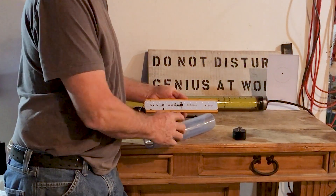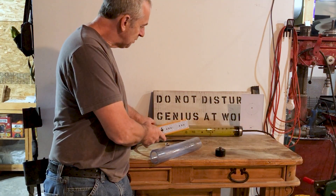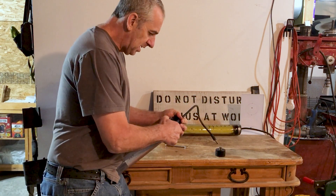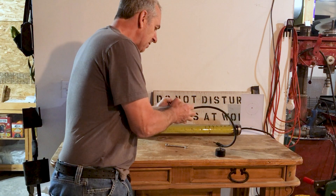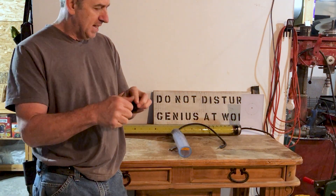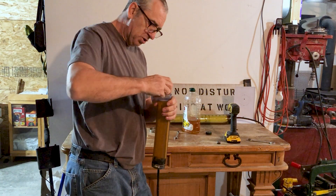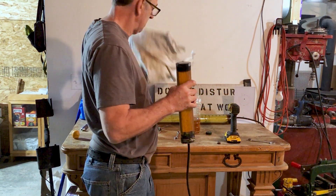Now I just slide it in. The LED board is mounted to a piece of puck board I had laying around — that's the backer to keep it rigid. This one I used wood, and I got a little pushback on that, but I'm pretty happy with the wood. I machined it so it's tight, and the o-ring is a little proud, so it takes a bit of effort to push through — and we're in. The other end is a solid plug with an o-ring groove and an oil fill plug. I fill it with good old canola oil before I put the end plug on. I push the plug on past the o-ring. I've overfilled it a little — that's what the shop rag is for.